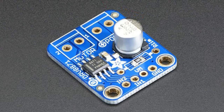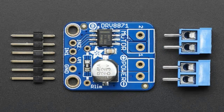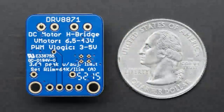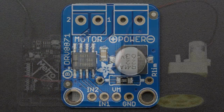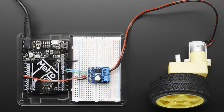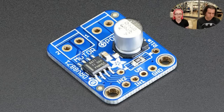We have a little motor driver. It's a cute little motor driver, but despite being cute it's quite powerful. Some people wanted high power motor control — these can do up to 3.6 amps up to 45 volts. They're very basic; it just uses two PWM or digital inputs to control the motor. Really good when you've got a large motor. It also has built-in current limiting, which I kind of like.